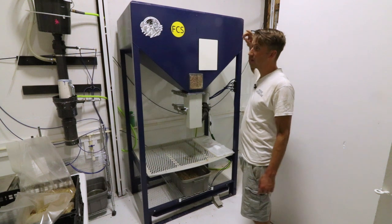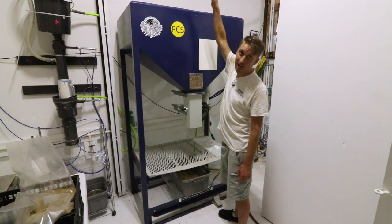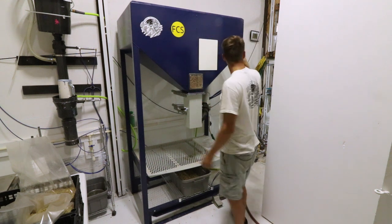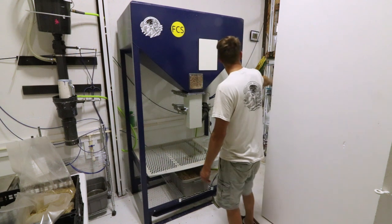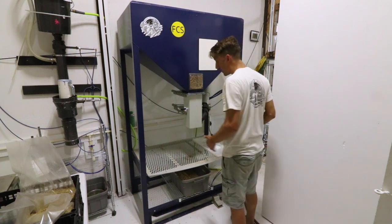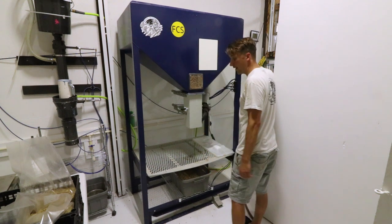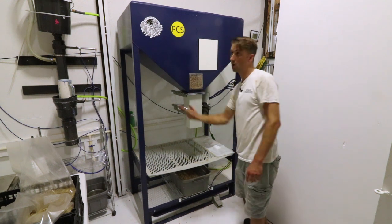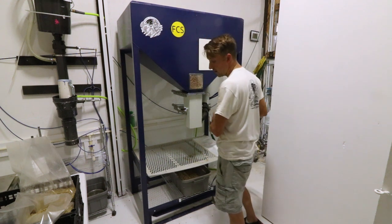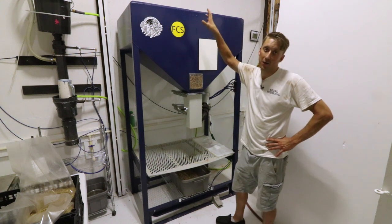The latest improvement I'm waiting on: me and TR worked out a deal — he's giving me his 20-foot grain auger. I'm going to have it hanging from a chain up here with some kind of adjustment cable or chain so it can swing left or right, going out toward my garage door. I'll have a hoist that raises it out of the way when not in use, but when I want to fill this up, I'll lower the hoist, dump into a hopper on the ground, and it'll auger up into here.